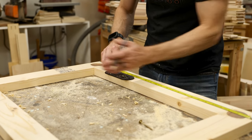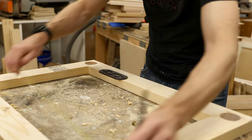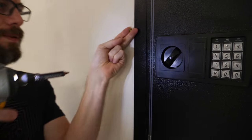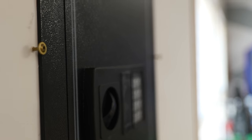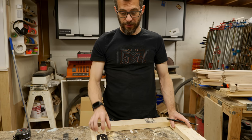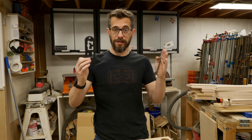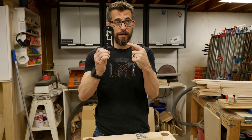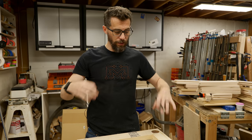These two things need to be exactly in line from one side to the other, so I'm just going to make a mark here at 17 inches — it doesn't really matter where it is as long as it's the same. That will give me the area to trace these out and route the holes for them. I'm learning — I realize that if this entry point is not centered within this key, then the keys can't be the same distance from the inside edge of the frame. You could easily modify this to fix that, which actually would probably be the best option. That way, if we ever want to swap out this key for a different one, we always have the same starting point right in the middle. So we're going to redesign these, remodel them, and then lay them out again.